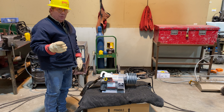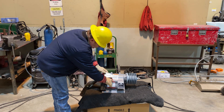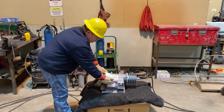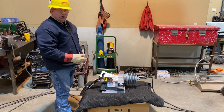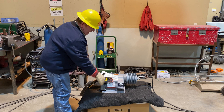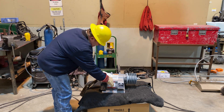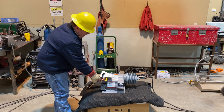We have a non-reclosed hotline tag handle. On this one we have a hook stick adapter attached. You can see I've written 'normal reclosing' — there's been some confusion about what this looks like from the ground. When it's back over here on the right-hand side, it's in normal reclosing. When we bring it down following this arrow, we're going to non-reclose.